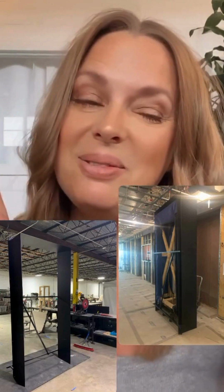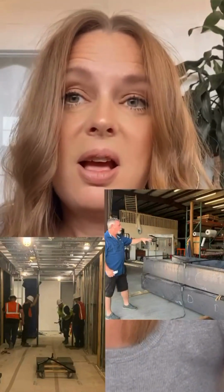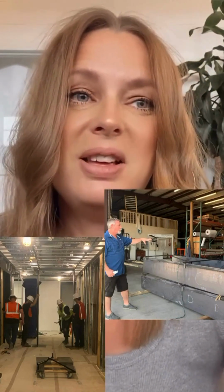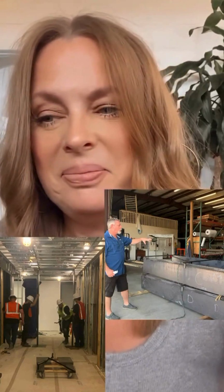But then we got to the site and the ceilings were lower than they were supposed to be. Not by very much, but steel doesn't like to flex very much in this configuration. So getting them into the building was a very big challenge. We did it overnight. I was there. I was part of the installation crew. We had 7 people to move each one of these 6 elevator surrounds, and it was hairy from the loading dock all the way into putting them in place. We learned a lot of lessons on that one. Actually, we learned lessons on every one, but we would do it a little differently next time.